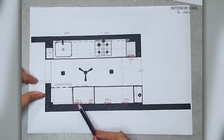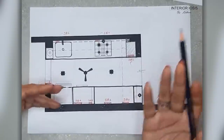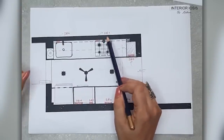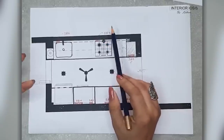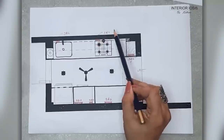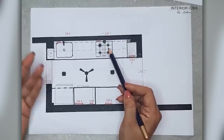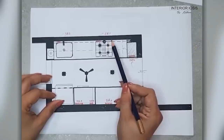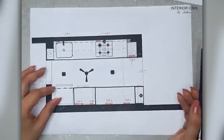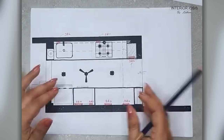As mentioned, there is a front-load washing machine and the inlet and outlet provision is also accounted for. We will talk about all this in detail. The switchboard connection covers the water purifier. The last switchboard is for your kitchen connection. There is a cooktop or hob here, and for the hob you need an electrical connection. If you have a cooktop or hob, an electrical switchboard is required under the counter — you need to check this with the model and the provider to confirm which switchboard, which points, and which fittings are needed.